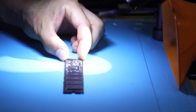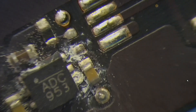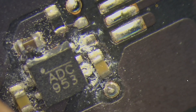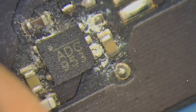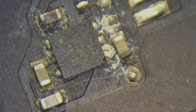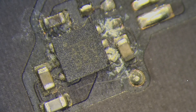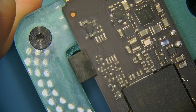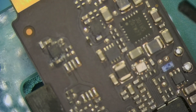Just quickly looking at the surface of this device, I can see where all the liquid landed. Looks like a simple enough job. If this power management chip is corroded, we're going to remove it. These capacitors that look cooked up can be removed, but I will also put them back because most likely those are filtering capacitors for stabilization. I'll begin by adding flux and removing all of these corroded components.